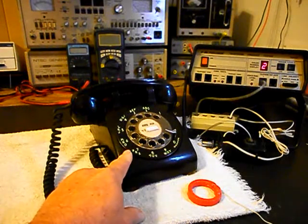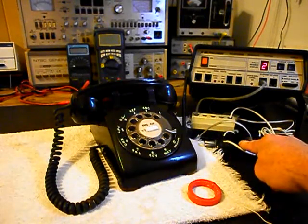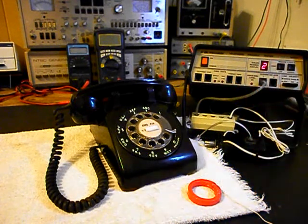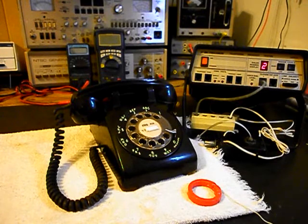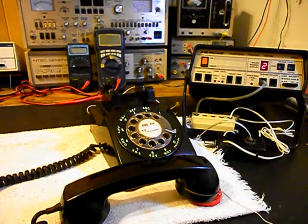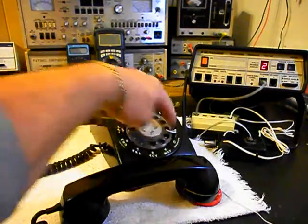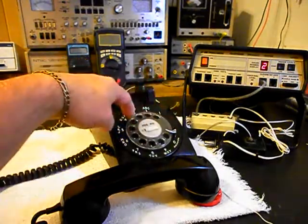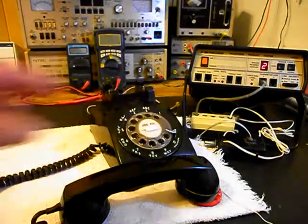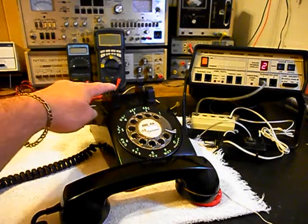Now that we know that this unit is ringing in on a ring cycle, we're dialing out, we have transmit and receive. We can go ahead and push this button on the switch box — that gives us a line out, totally takes the analyzer out of the situation, and we can call the time and temp number. We'll go ahead and give you some dial tone and we'll make that call. Today is Friday, November 10th. The current time, 8:43 p.m. And the temperature, 43 degrees.